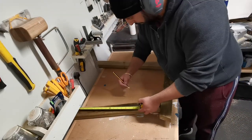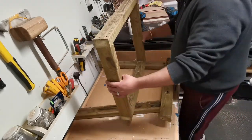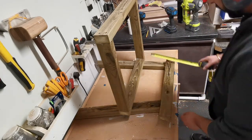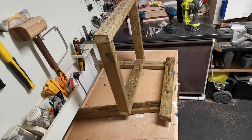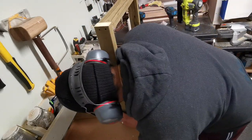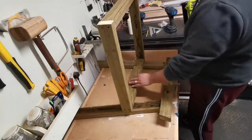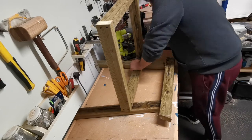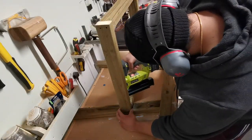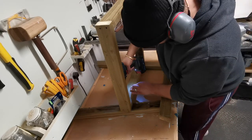Moving on, I'm using one of the leg pieces to mark the distance I wanted from the floor. This particular chair I designed to be slightly higher up because it was going to be for an elderly person, so I wanted it a little bit higher than usual. If you want to adjust the height, this is the ideal time to do that — higher or lower depending on your preference. I then position the seat in the right position using copper nails and screws to hold everything in place, and after this I screwed the other side of the leg in the exact same manner.